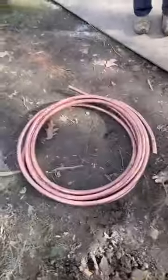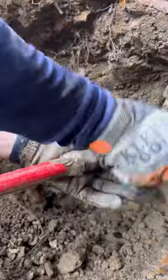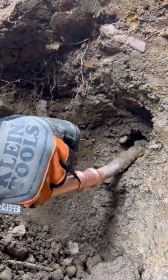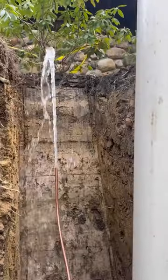A lot of times when I'm doing this work, we also run into the water line, which we did this time as well. We're prepared for the water line — what we do is a controlled cut. I actually cut away the section of copper and just peel it back as I dig, and at the end of the day I'll hook up a temp hose and restore water to my client.